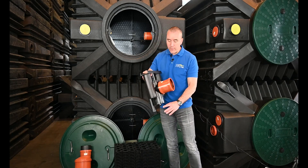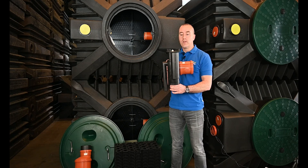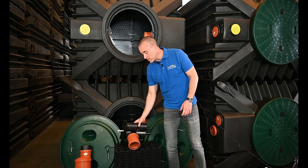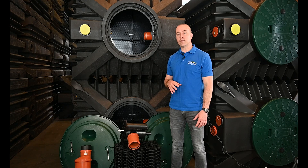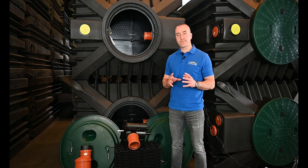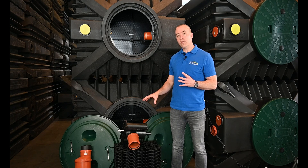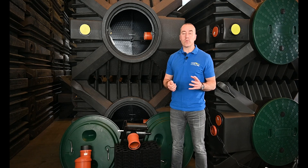With the ClearFox Nature, we have a patented flow control device. If you look at the video on our website, it gives a really good description of how this works. The patented flow control device is positioned in the buffer tank. If you buy a complete system from us, it's pre-installed. If you want to put the bioreactor after your existing septic tank, then we put the flow control device or throttle into your existing septic tank. This guarantees that your system will not be overloaded — other systems on the market don't have this feature. The flow control device is also a non-electric part; it's a simple mechanical device that requires minimal maintenance — just a quick inspection every year and maybe a wash with a hose.